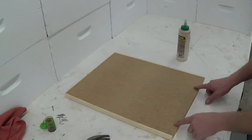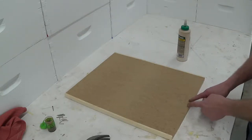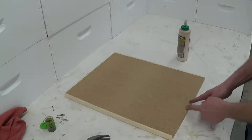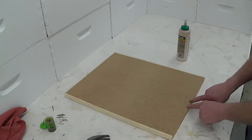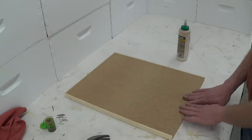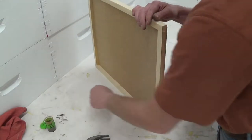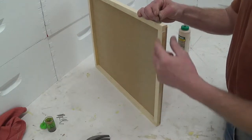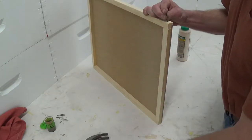Okay, so when I nail the narrow ends, I try to offset on one end a nail a little bit from center so I can put my winter ventilation groove in on the winter side with the table saw after it's all put together. The next thing I do is take the inch-and-a-quarter nail and give it a little extra strength by putting it through the corner.